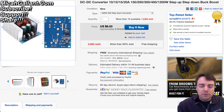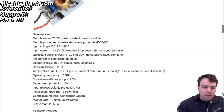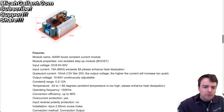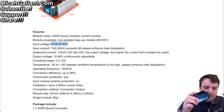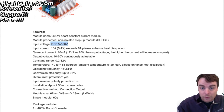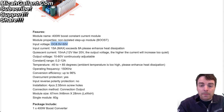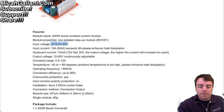You give this unit anywhere between 8.5 volts to 50 volts, so 18 volts, and then you can dial it down via the potentiometers to 13 volts, for example, which is what you need for your 12 volt system. And then all of a sudden, this 18 volt Makita battery, along with two others potentially, are in the operating range of the rest of your 12 volt system.